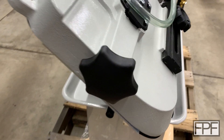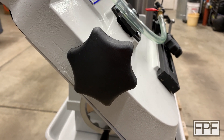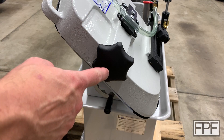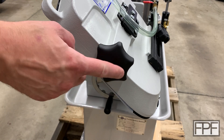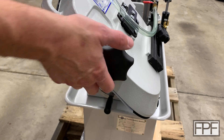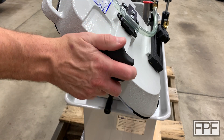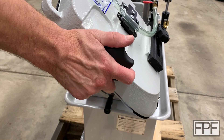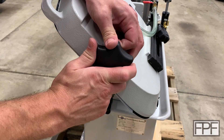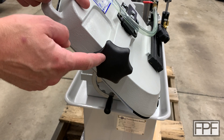So I'd like to make a wrench for this knob — you can see the shape it's in. We've basically got to come up with a wrench that is going to fit over that shape. Turning this clockwise would tension the blade and turning it counterclockwise would slack the tension off. I can turn it counterclockwise with one hand, it's still hard, but I literally cannot turn it clockwise with one hand. I need two hands to do it and that's just a pain, so I'd really like to make a wrench for this so that I'm not killing my wrist and we can do it a lot quicker.